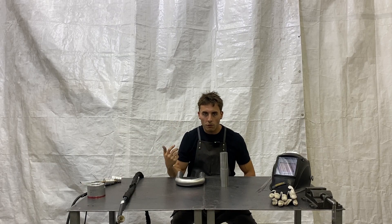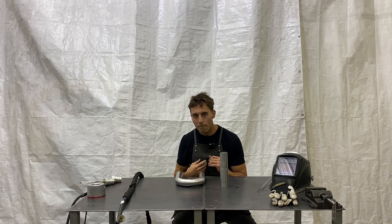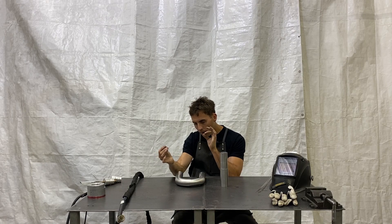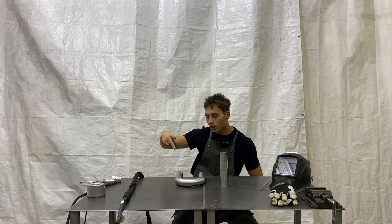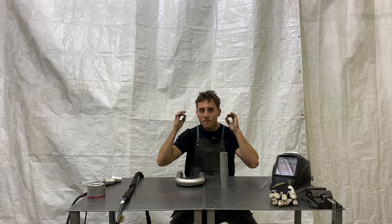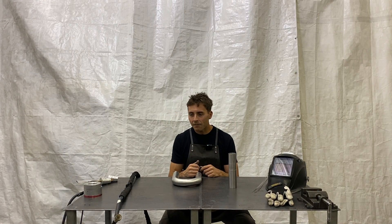I always teach to find that perfect amp. In this case, we're going to do 40 amps on this straight lap joint and we're going to slam that pedal wide open and wait. And then we're going to start ripping — start coming around — because that's going to keep that puddle, that torch, and that arc consistent, because we are going for beautiful, perfect welds. So let's dive in.